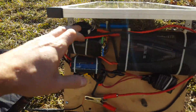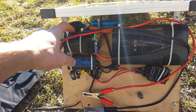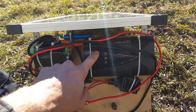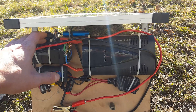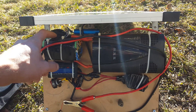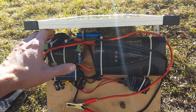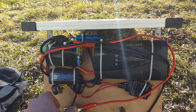This LiPo is actually equal to about a 16 amp-hour sealed lead acid battery. And at higher discharge rates it's equivalent to even more — if you're pulling at least one C, that's eight amps out of this for 80 watts output, it's equal to about a 16 amp sealed lead acid. But if you start pulling 20 amps for extended periods, it's more like a 22-to-24 amp equivalent, because a 22-amp sealed lead acid rated over 20-hour discharge will only actually deliver about 8 amp-hours before it dies.